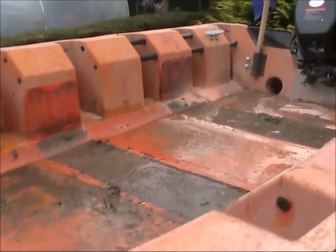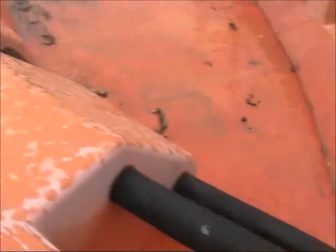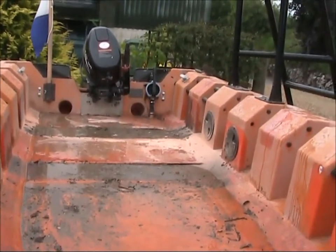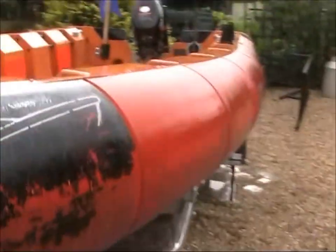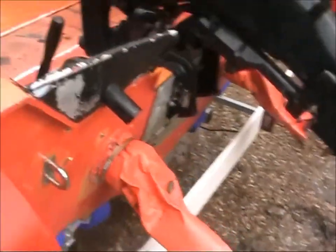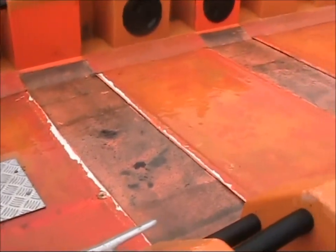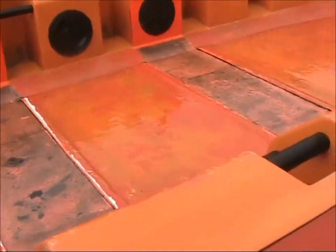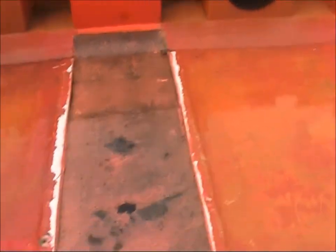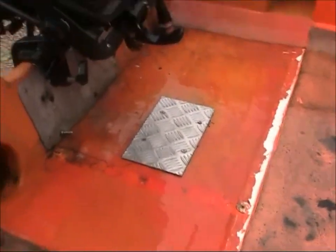Here we go - we've finally got the other side, we've got the seat out. This is what I mean about being able to just wash the whole thing out all the way down. It's the first time that water's been able to run down there from the top to the bottom and escape out of the elephant trunk. You can see obviously where the two seats were, and that's going to need tidying up. They've still got to be ground down where the edges are. But this was the general idea - a nice straight-through deck so you just wash everything out the end.